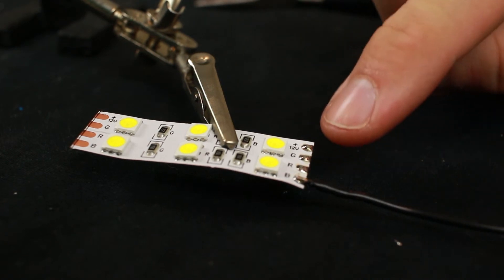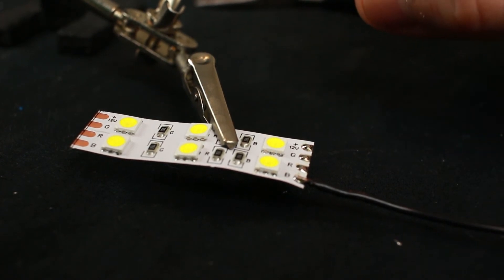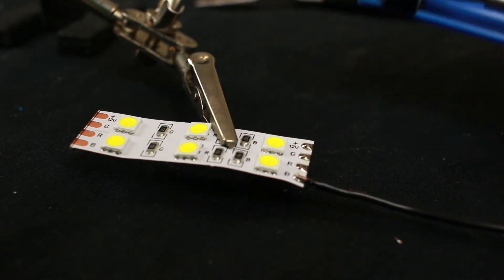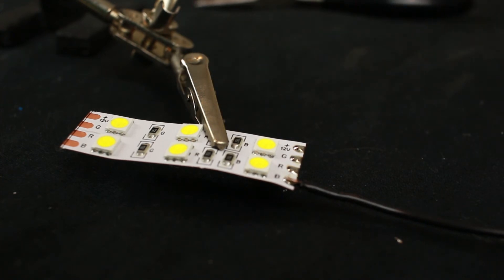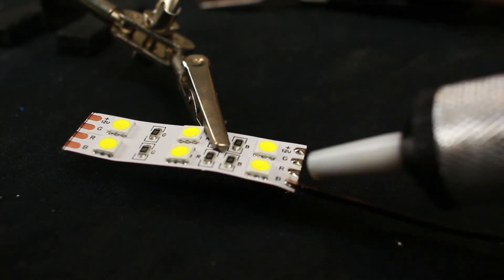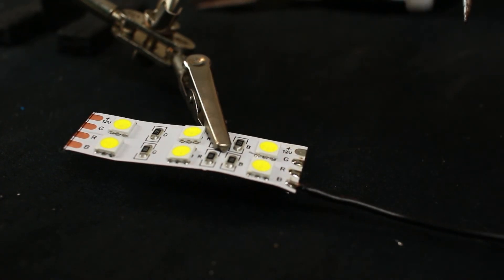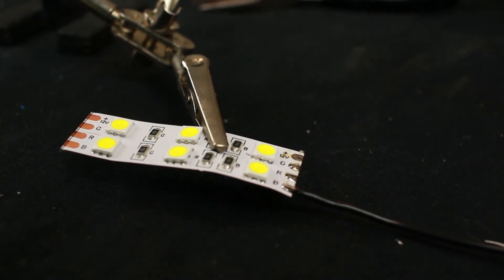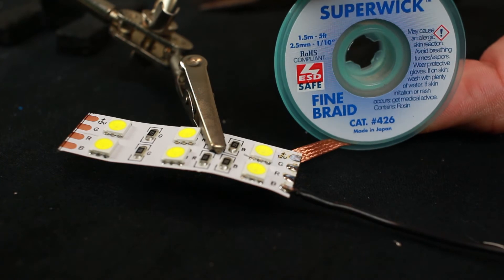Now let's say there's a problem — on one of these solder pads we added too much solder and you're hitting it with a soldering iron trying to pull it off. That's why we have the solder sucker tool. We're going to depress the plunger so it's loaded and ready to go. We hold the plunger in one hand and the soldering iron in the other, heat the solder, then hit the button to draw the solder up. There you go — the plunger tool is better suited for work with wires.